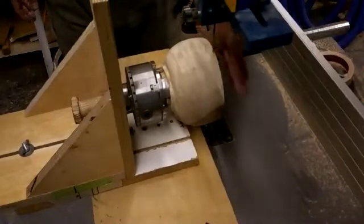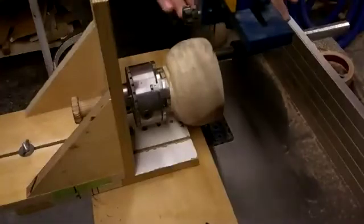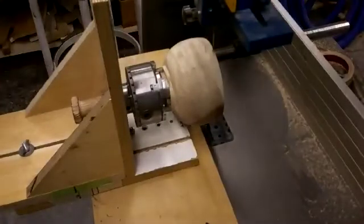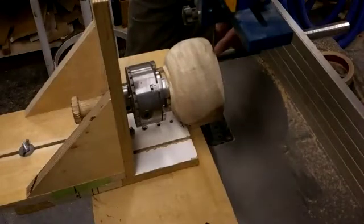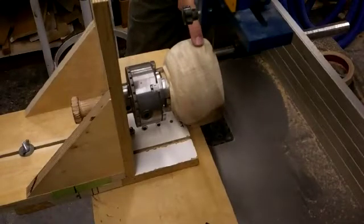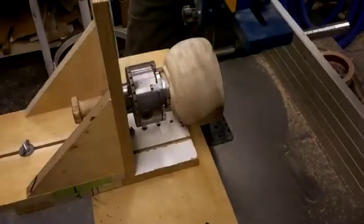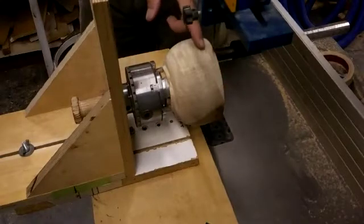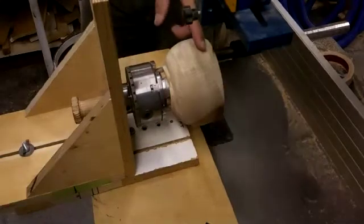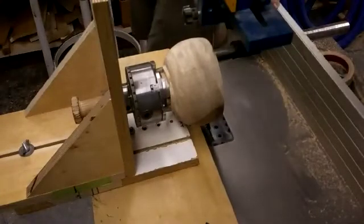If they're not lined up to the blade, you can tilt the table of the bandsaw and accommodate it. So I could rotate the table left or right and make sure that I want it touching top and bottom, because that way, when I cut here, it's also the same equal distance on the bottom, so it's a nice balanced piece. If I'm not touching the blade squared up to the blade, then on this side, the wave could be higher than on the other side. So that's what I'm looking for right there.